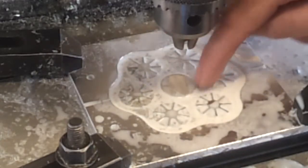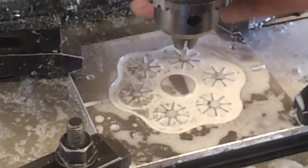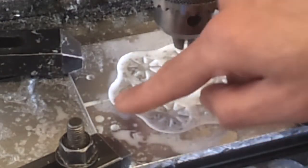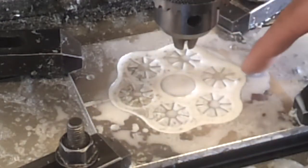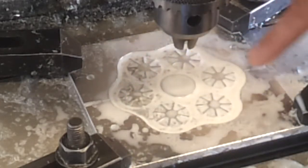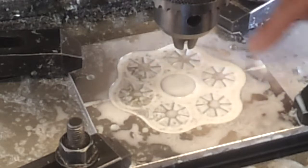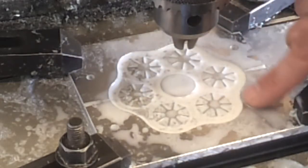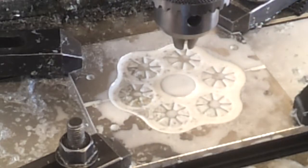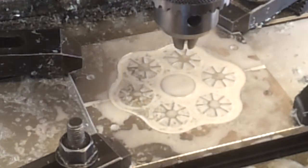The cavity is now all finished. Need to do the central feed and some gates. I've just added the vents on either side, and these are 50 microns deep, so I've referenced off either side to make sure they are the correct depth. Also got some little referencing slots in the corners in case I need to put this plate back on. Probably won't, but it's worth doing them just in case.